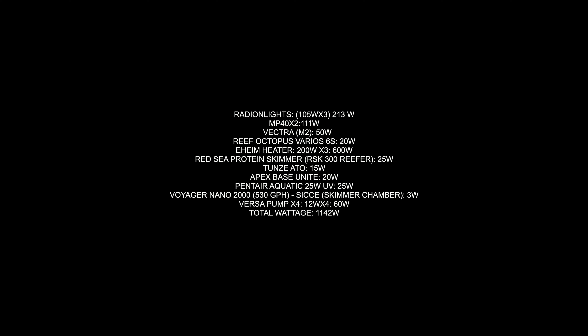The last example is where I try to run my whole system with lights and everything. In that case, the total is 1,142 watts to run my entire system, so that would last about three hours. That probably covers the average outage, but it just goes to show how much power you need to run a system. For comparison, the Ecotech Marine backup battery is 18 amp hours — about 216 watts. Those are just some real-world examples of how I would use this system.